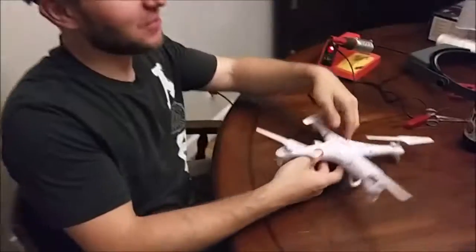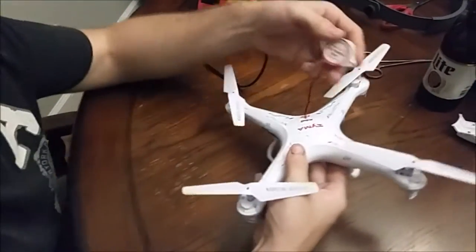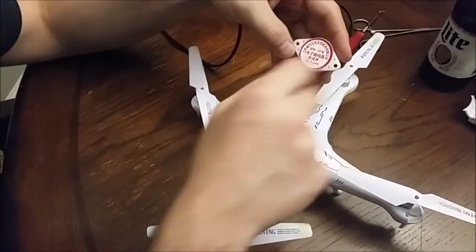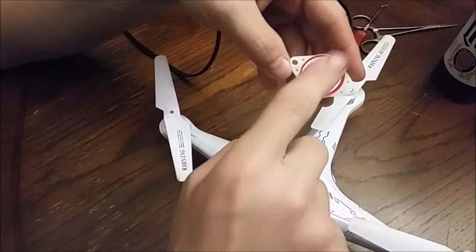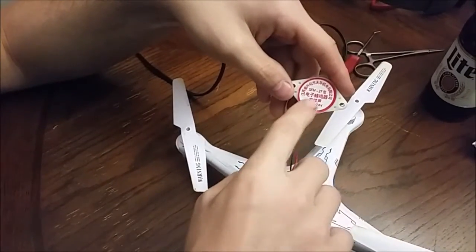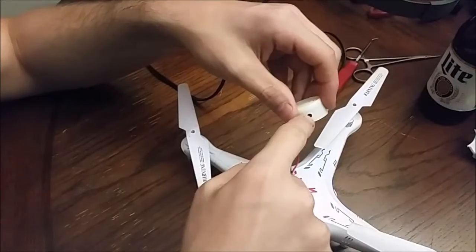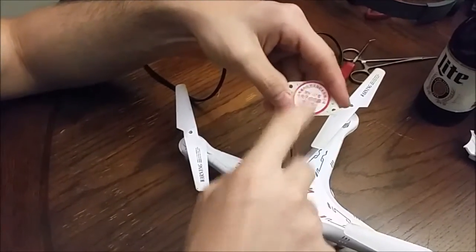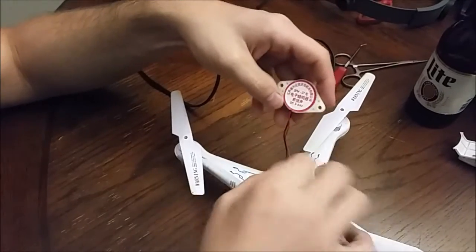That's good because it saves your battery, but the battery is like $5 and the drone is $50. So what I did was take a buzzer I ordered off eBay. It works between 3 and 24 volts and it's what's called an active buzzer, so it doesn't just beep constantly when power is applied — it actually oscillates. There's a timer circuit in there, I think it's a 555 timer circuit, and it oscillates every half second or so.